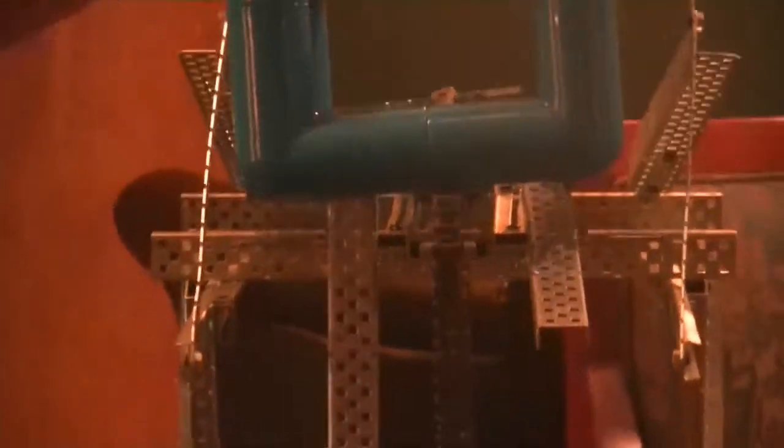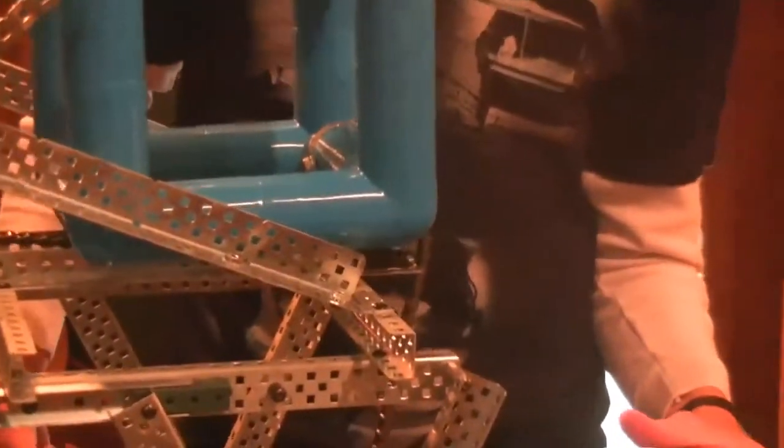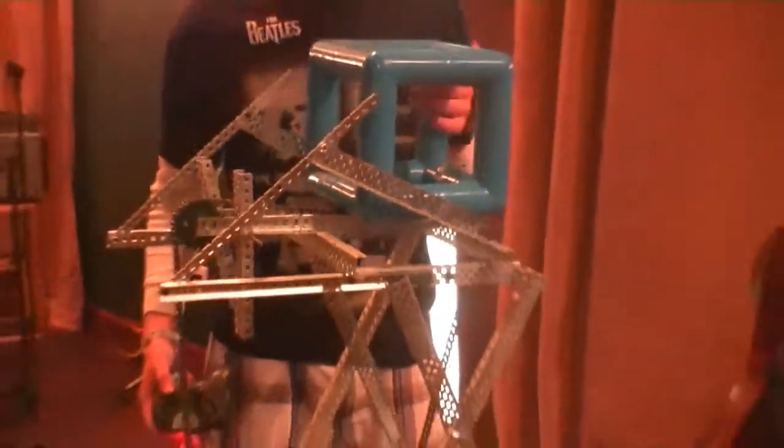And there demonstrated how these passive beams work. They simply brought up the back end from getting caught on the sprocket. And these guide rails help it to stay straight as we bring it over the back and drop it onto a Skyrise section or a post, whichever one we're doing.